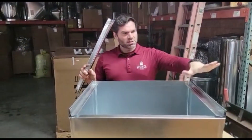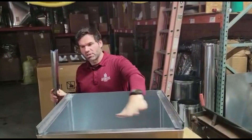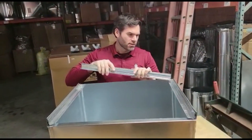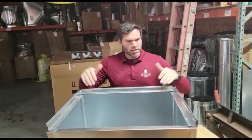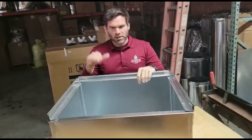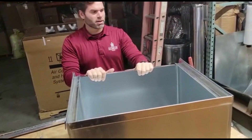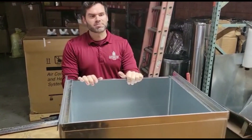I've got my last piece here. The most important thing to remember is that you need to make sure to put your side pieces on first, then put your back piece on at the very end. The reason for that is your air handler is sitting on a little bit of a slant, and that way it will for sure drain correctly and you won't have an issue. And your box is finished, minus sealing and just attaching to the actual air handling unit. Thanks for watching.